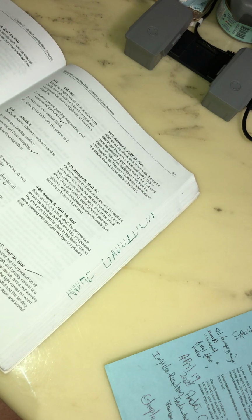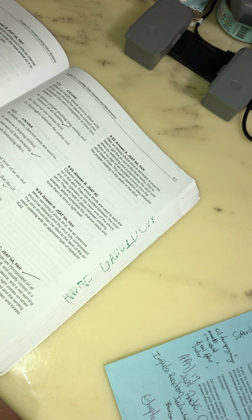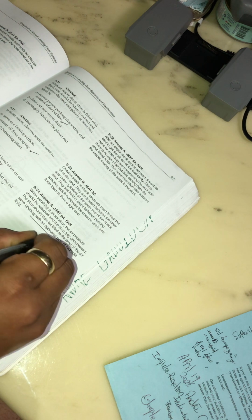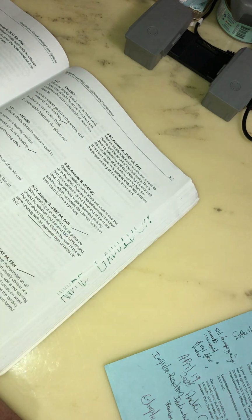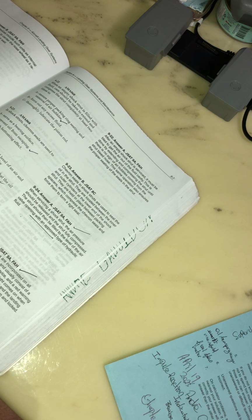When servicing a shock strut, the air pressure should be released and the strut fully compressed. The strut should then be filled to the level of the air valve opening with an approved type hydraulic fluid. This was A, correct. Release the air and see that the oil is to the level of the filler plug.